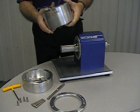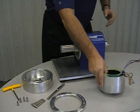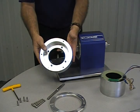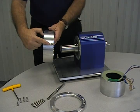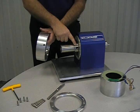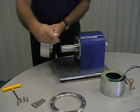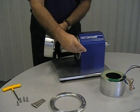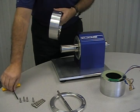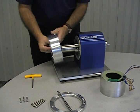To mount the stator to the demo unit, a stator adapter will be used. On the stator adapter is an alignment hole, and on the shaft is an alignment hole. These two holes will be locked together using a locking pin. The adapter will be connected to the demo by four M6 x 25 bolts and will be tightened down using a T-handled Allen wrench.